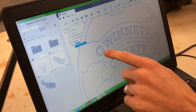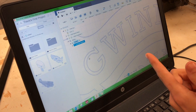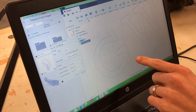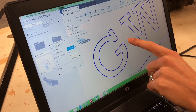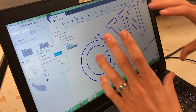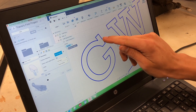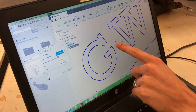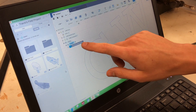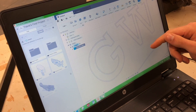Jumping back — the arrows for inside and outside can sometimes be hard to see. I'm going to use this one as an example. If I edit my cutting profile again and go to Geometry, see how this arrow is way to the outside? But when we say okay, the cutting profile is on the inside. That may be confusing. What I missed earlier — if the geometry is small, like this letter which is probably an inch tall, the line doesn't move inside or outside like you'd expect. If I click this arrow right here, now this is going to be to the outside.